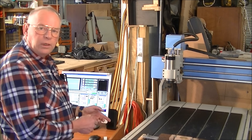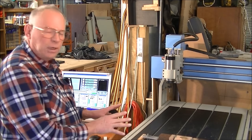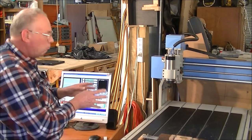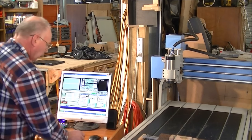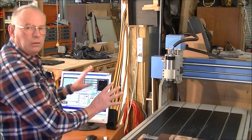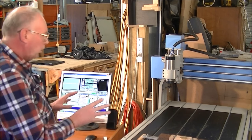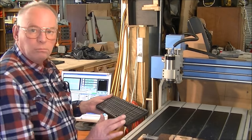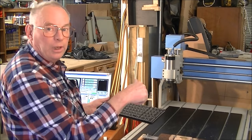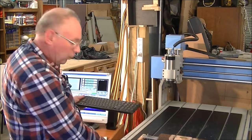That noise in the background is the air circulation fan through the electronics of the CNC machine. We've been running for about 10 minutes, so all the electronics are up to working temperature. To make the machine active, you need to press the reset button in Mach 3 — now the machine and computer are linked together. You can operate it via the arrows on the keypad: arrows move the X and Y direction, and Page Up/Page Down operate the Z axis. We'll bring the gantry all the way up to the home position at the far front corner.